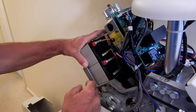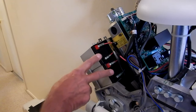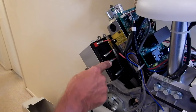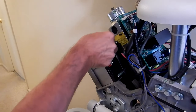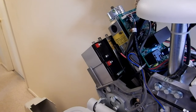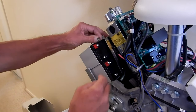We're going to take the wires off of the batteries. I've got the clamps loosened. There's a center jumper here - these are two 12-volt batteries in series to make a 24-volt output. The center wire goes from the negative to the positive. I'm going to take that jumper wire off and set it aside - it's just a little U-shaped wire. I'll also take off the fused side from the positive one and disconnect the negative one that goes to ground. Now the batteries should be ready to take out.